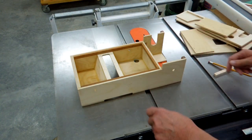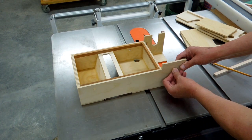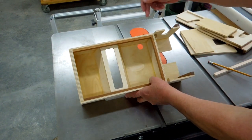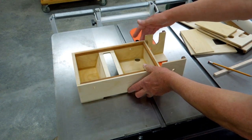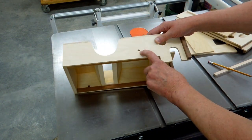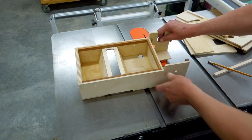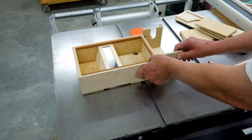Crankshaft goes through here. Your handle for playing the organ is here. I intend to use a bushing in here. This will press in from the other side. Rewind mechanism goes in through this hole. Your clutch mechanism comes in through here to disengage the drive, and that's so you can rewind it. The drive for the spool comes in on this side, and that's what drives the take-up spool. And the hole in the bottom, this is where the air comes in from the reservoir. And this is clearance for one of the connecting rods.